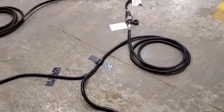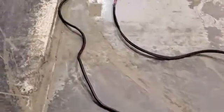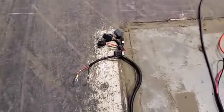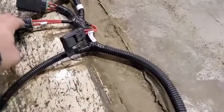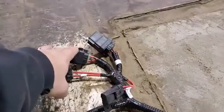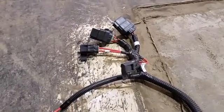Also at that Y is where we get power for the tractor harness. We can follow that all the way back to the plugs at the battery. There are going to be two fuses — here and here — and also two relays, one here and one there. We'll get into those in the troubleshooting section.